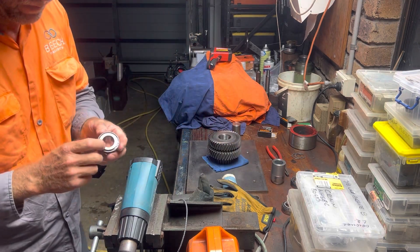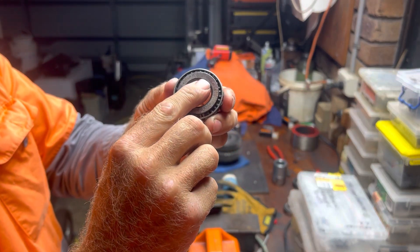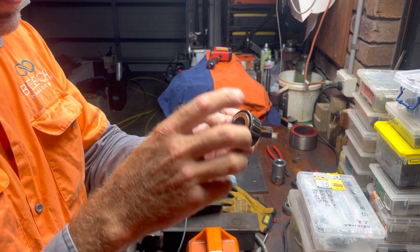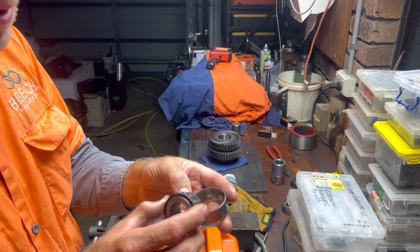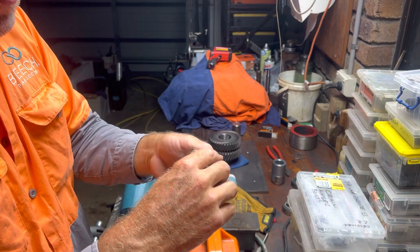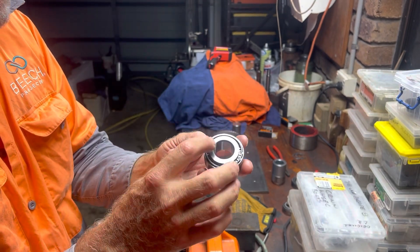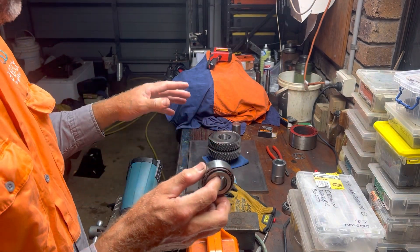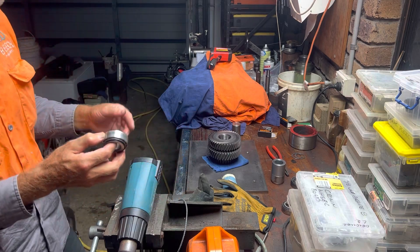What I did was measure the height of the race from one side to the other - you can measure that with a micrometer accurately. I noticed there was a variance in a couple of the bearings - same brand, same part numbers. What I don't know is how well the cups are matched. You might have a bearing that's shorter, but if they machine the cup differently. The measurement that matters is from the seat registered against the shoulder - or in our case a circlip - to the other part of the race. So even though that was different on a couple, the overall might not be different.